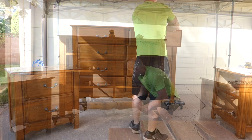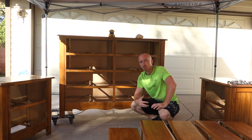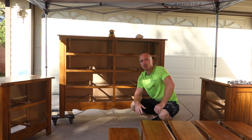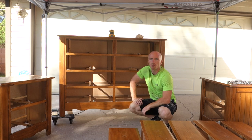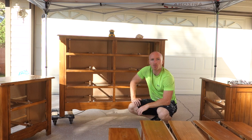All righty, this is all stripped down, all the drawers came out. When you start taking all those drawers out you start getting a little overwhelmed about all the stuff you have to paint, but these got really nice lines so it'll paint really smooth and quick. Next step is sanding — we're going to use 120 grit sandpaper, go over the piece, try to knock out any imperfections or smooth them out as much as possible, and then we can start prepping for paint.